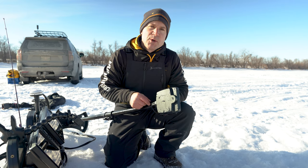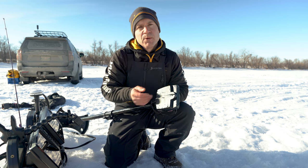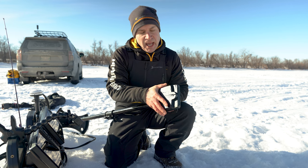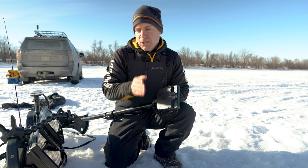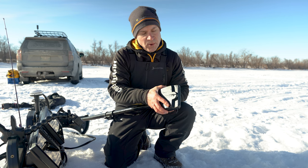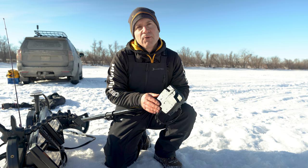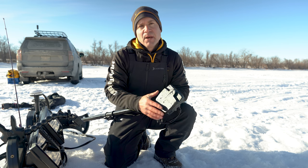An important consideration when setting up the transducer angle with your Humminbird Mega Live is very straightforward in down mode — it's basically pointing straight down. But once you adjust to the forward setting, every click is basically 10 degrees. When doing your settings adjustment in the menu, I typically want to make sure the angle coincides with what I've actually adjusted on the transducer. For example, if I have it 1, 2, 3, 4 clicks — which is 40 degrees — I want to make sure that coincides with the 40-degree angle on my screen. That's going to make sure you have it paired together and give you better imaging.